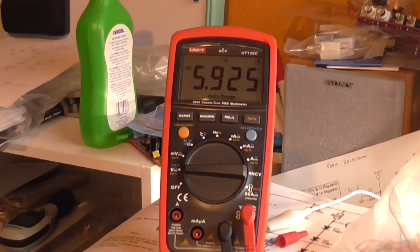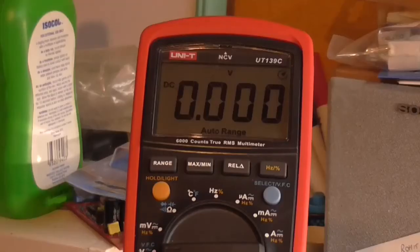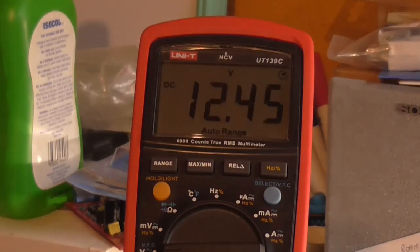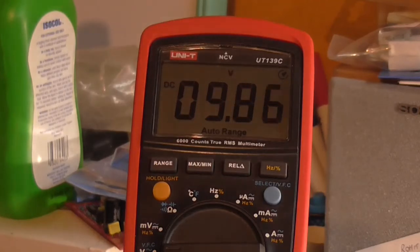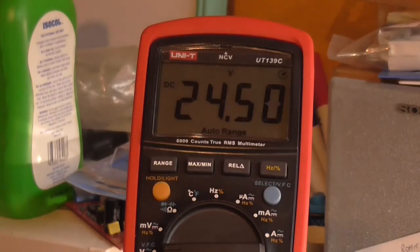And yes, my output's still loaded. Hang on a sec. Okay, without the output loaded now, yeah, it's not remaining very stable at all, is it? That's rather weak. It's just not remaining stable. Not exactly sure why. It should be remaining stable, but if we increase it, we do actually get a larger current draw. In fact, it seems more stable there,